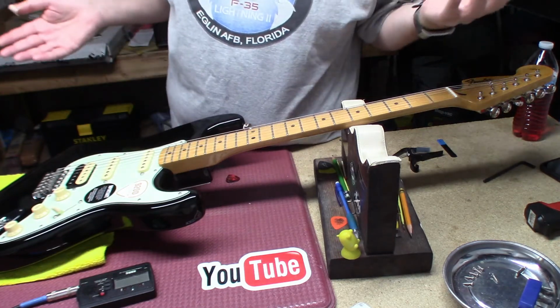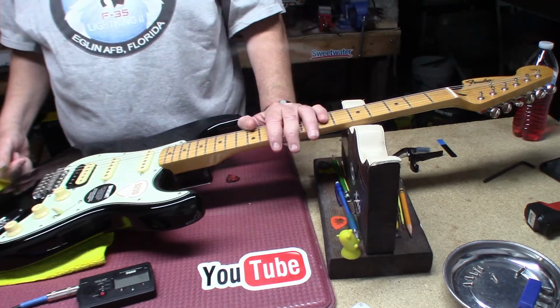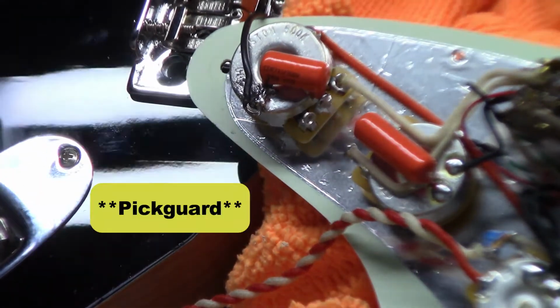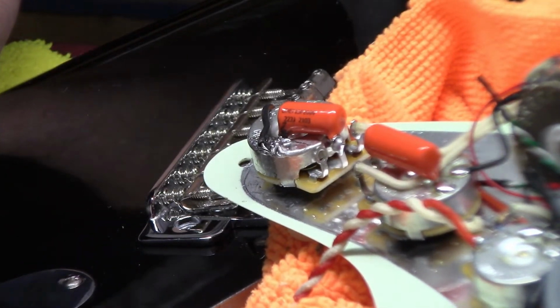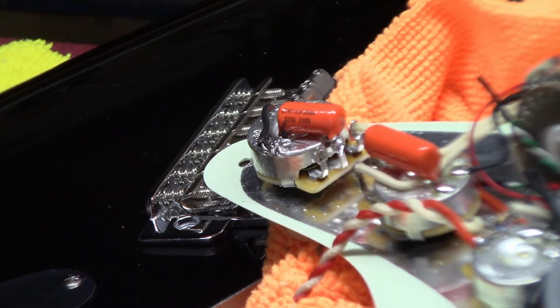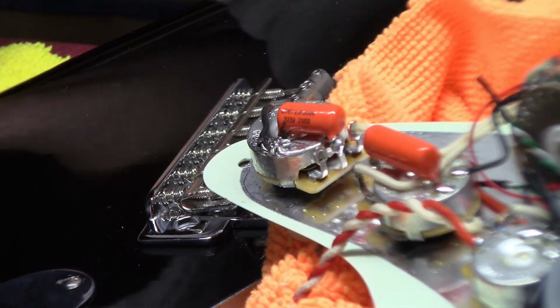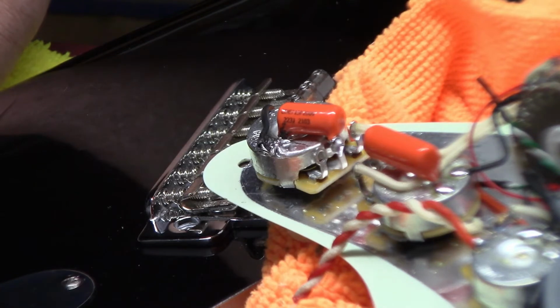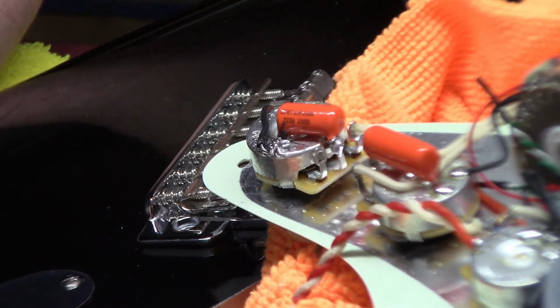All right, so the sound works. Unplug the noisemaker, change the strings, and check his soldering just to make sure that it's cool. Everything's pre-soldered, so the only thing I can imagine that he's soldering is the ground wire. But we'll see. Oh, it is a pre-wired pickup, and the only thing he had to do is solder this on, and it looks fine. It's not the prettiest solder joint in the world, but I've done worse. As long as you have continuity, I think you're fine. I would suggest that he put some shielding paint in there, but these are designed to be quiet pickups to begin with, so I really don't see a big deal. I didn't hear any noise when I played it just now, so let's button it back up. I think he's good to go.